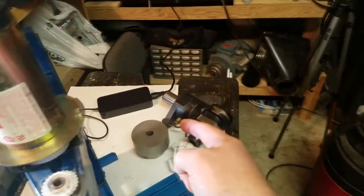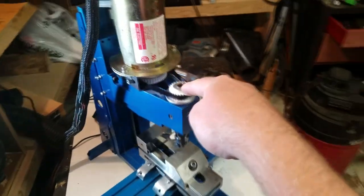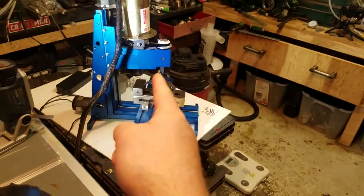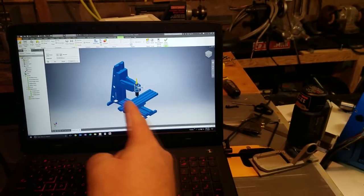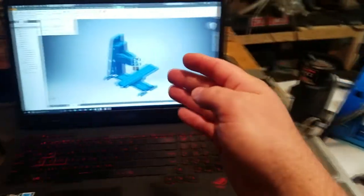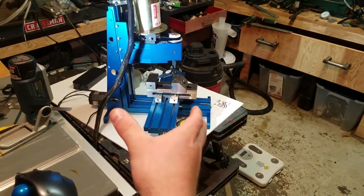And then over here, we're going to put 20 pounds, which is essentially all of this garbage. I weighed it out. It's 20 pounds. We're going to take all of that, put it on the spindle, see what the indicator reads, and then see if this matches that. If it matches, then we can use this to quickly troubleshoot and see where we're getting deflection, and throw all of our ideas at this electronic copy instead of this real-life copy. We can save ourselves a lot of headache and time and see what needs stiffened up here, and then we can look on here and say, how do we do that in real life?